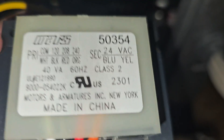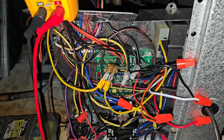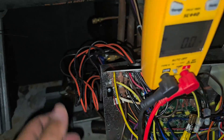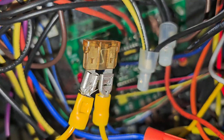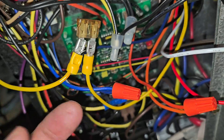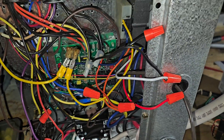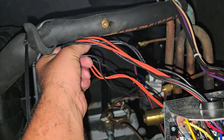Before we mount the transformer, figure out which wires I'm using. I'm going to use white and orange — so common and 240 — and then blue and yellow. I'm going to cut the power back on. I've got these wires taped and secured. Had to cut a wire tie. There's my fuse in line with the R on the secondary side of the transformer. I'm going to tape both of these spades and then reconnect them. Also, all the wires you're not using on your primary side, make sure there's a wire nut on there. I'm going to take all these wires and wire tie them up here, because what happened was they got pulled tight and wire tied right here and were laying up against that copper piece. So I'm putting them right here — no chance of touching anything. Got that wire tie in place, wires are no longer touching.